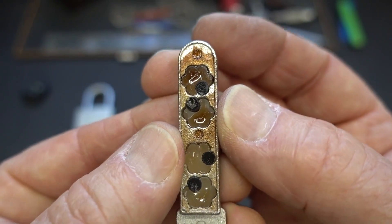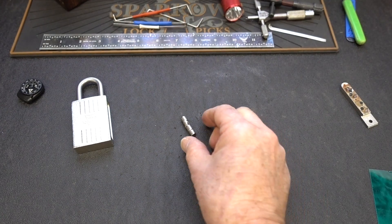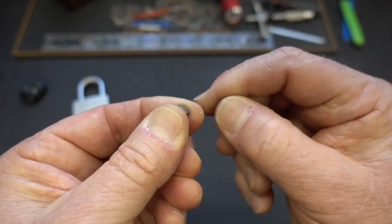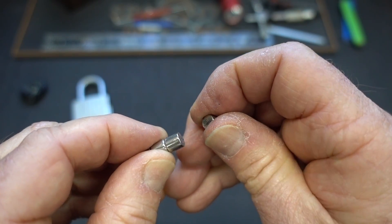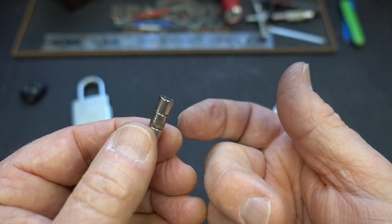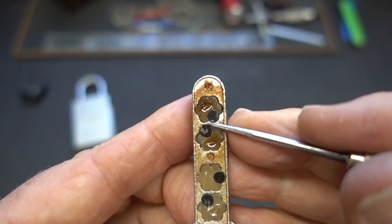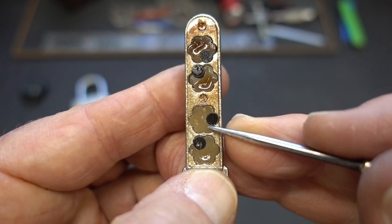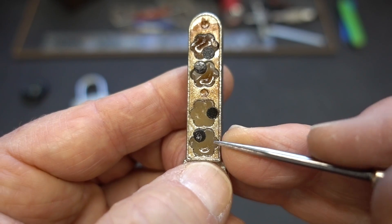From a practical perspective, when you put magnets close together they like to orient themselves and stick together. They're going to track north to south, and like poles are going to repel. So if I take a magnet and try to position it inside that cloverleaf in an adjacent cylinder, before the glue dries that magnet is going to pull itself out of position and do its best to flip over. We can greatly narrow down the combinations — these two magnets, if that is north then that is south and vice versa, and the same for the other pair, because they're in fairly close proximity. That way, when the magnets are put in, they'll stay pretty well located and not snap to each other while the glue dries.